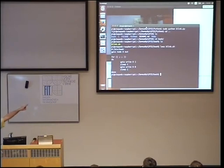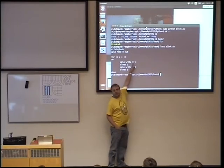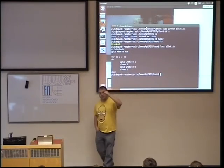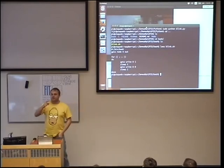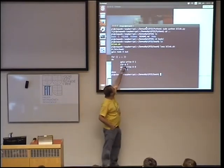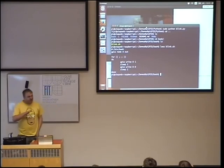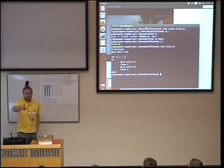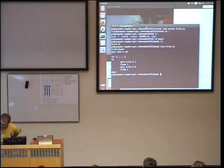The cleanup is handled inside the GPIO, so it works a little differently. How does it know the number 11? Because I am working with number 0, because this library uses the numbers of the pins from the chip, not from the connector. But if you write the application in C, you can choose which numbering style of the pin you want to use. Here, this simple tool uses a different style of numbering. It's sometimes really tricky, because you try it, you connect it to zero and nothing happens. By the way, the zero pin is plus 3 volts, so be careful.